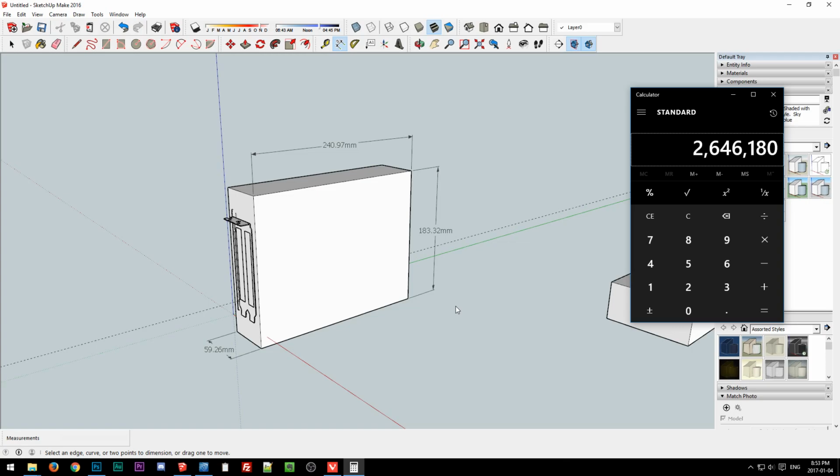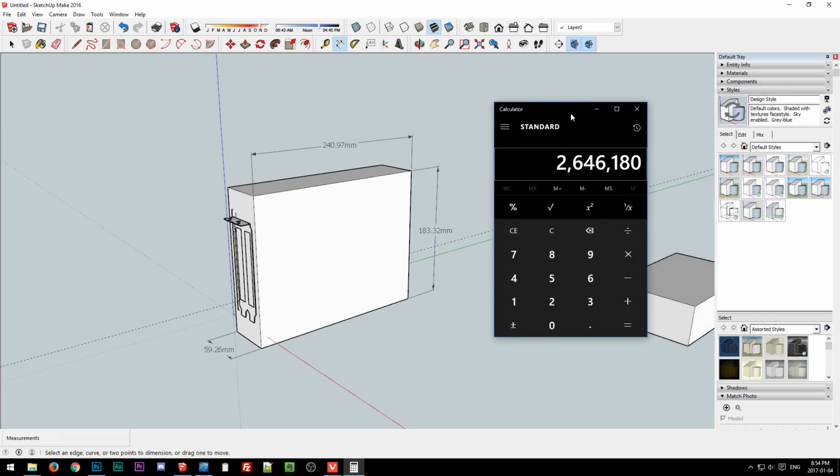So anyway, I'm just going through this in general. You're looking at a case, you see all the dimensions in millimeters, and it's like, well, what is that in liters? So you can take the 3 dimensions in millimeters and multiply them together. You'll get the volume in cubic millimeters, which isn't particularly a useful number. Most people don't have a reference point for how big or small something is when you tell them how much it is in cubic millimeters. But that's the cool thing with metric: I can just move the decimal place 6 times to the left.